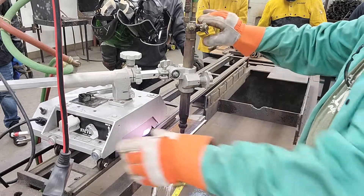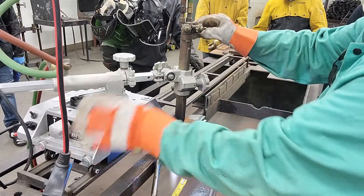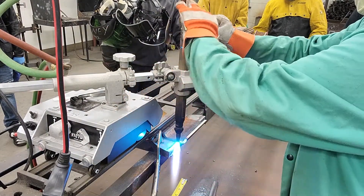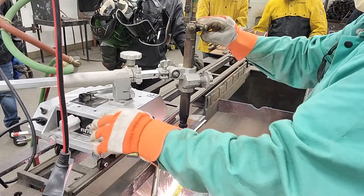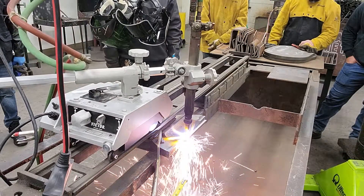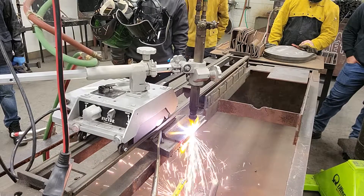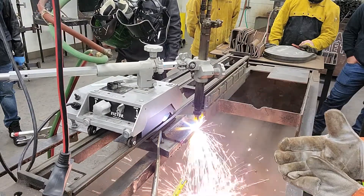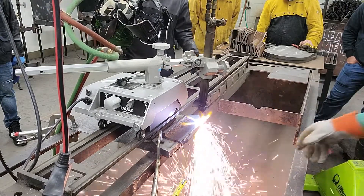We get it right down there, we get it warmed up, we turn this on nicely and gently. It's not hot... it's hot. We get it back. Then the other control is this big knob here for speed. If you get the speed right — just like welding — distance, angle, speed, and heat. If you've got everything right, you make a good clean cut. And if it's a good clean cut, then there's no slag on the piece that you cut — it's the one you're going to need.